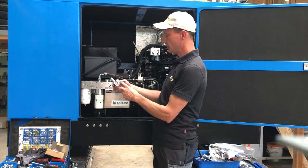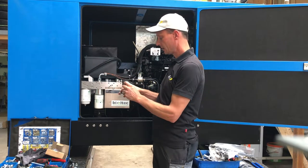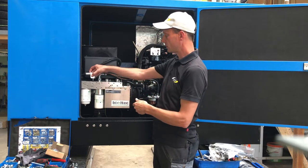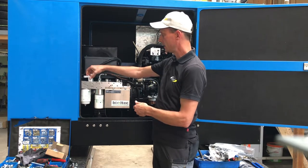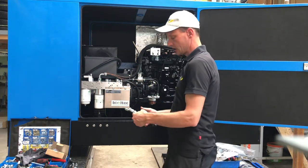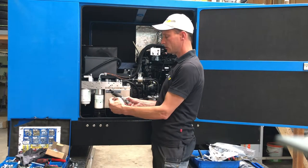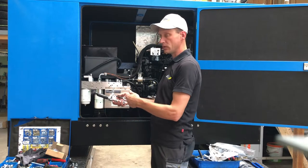And you can see we have two connectors in one, so it is connected here, and we will have the fuel in the inner tube and covered by hot water in the outer tube. It sits like this and can be rotated easily. We have an example for this, which is cut out. So again, we have an inner tube and an outer tube and a coaxial system for heating the fuel lines.